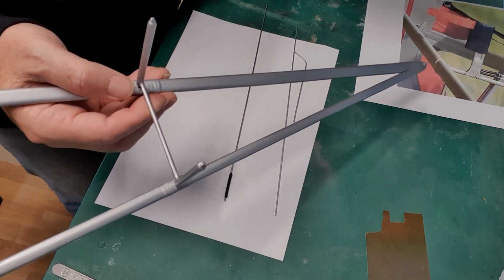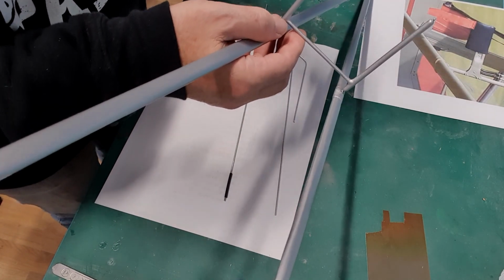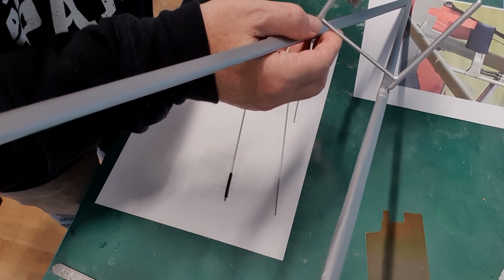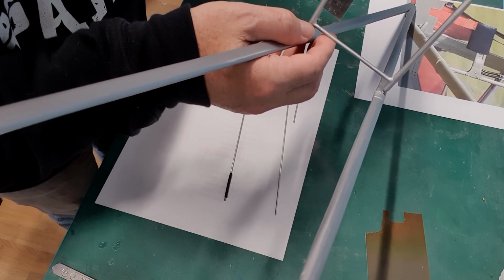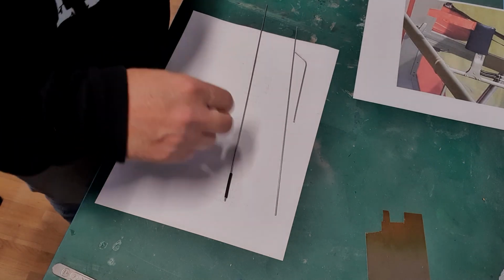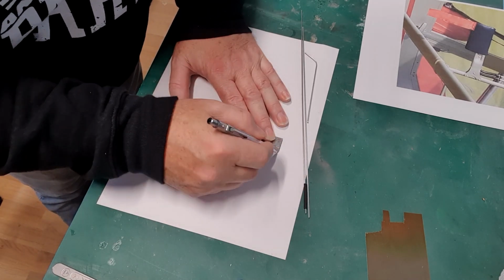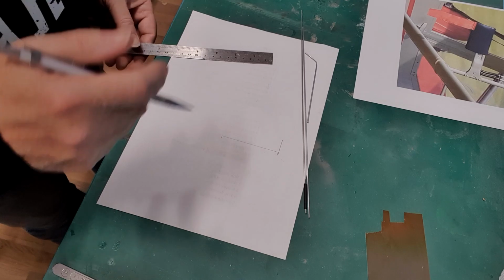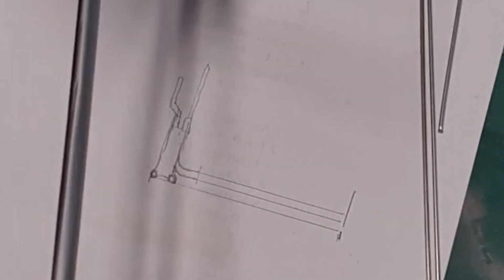that is going to run from the top, this bracket, to about 4/5 of the height, and that's where the bracket will be. So if we make it, let's get the right measurement, in millimeters, metric, so if we bring it down to 70 millimeters from the joint, this beam is a little bit higher, so we know that this has got to be 70 millimeters long. Well, the wing underside here, then we want to come down 70 to here, so that's how long the tube's going to be. That's roughly the size that I need it to be going by that strut.